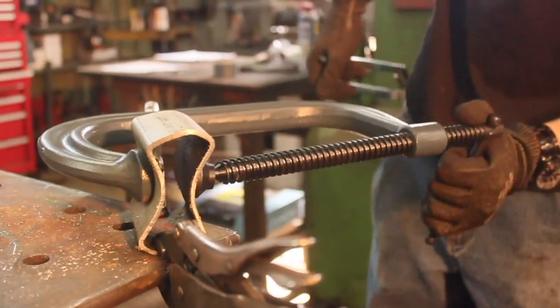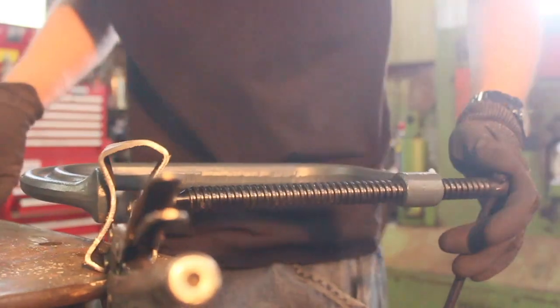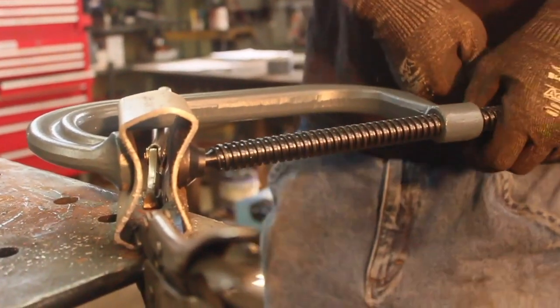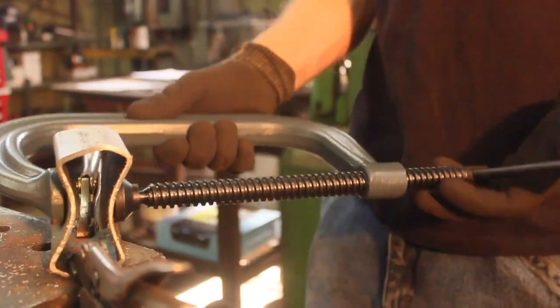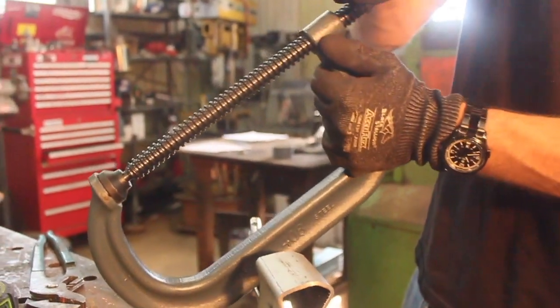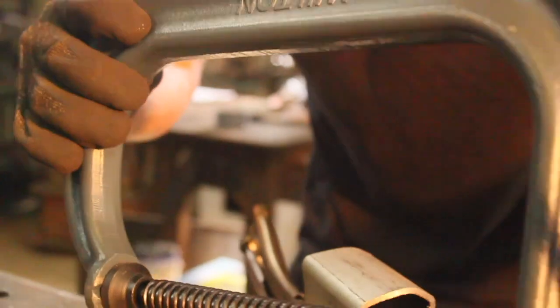As you can see, it looks just fine — no noticeable deformation. Well, maybe a little bit; it looks like the screw is starting to move out ahead of the front of the clamp. But I don't see anything damaged. This piece here isn't torn and the screw doesn't appear to be bent. Let's back this off. When we put this together, you can see this pad here isn't 100% centered but it's really close. It's been put under fairly extreme loading and there's no noticeable permanent damage at all to this clamp.